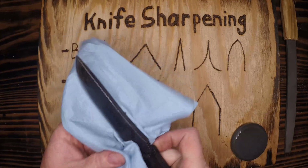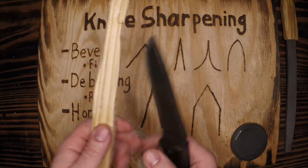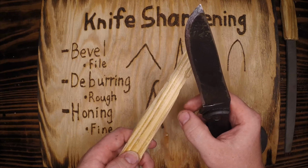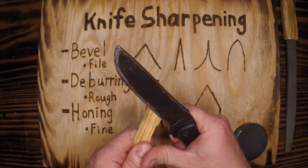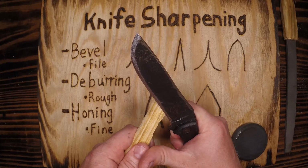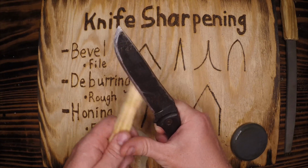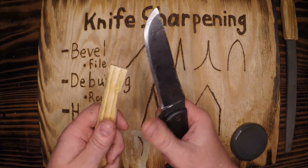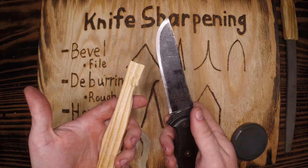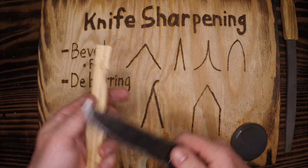The most common issue that we have is with carving, and I'll be using this piece here. Someone will want to get something carved down or knock off a piece of wood. See this little burr here? If you're cutting towards yourself, even if I'm placing a thumb for control, and I've got a little experience here, even if you've got a nice sharp knife, and I'm not pushing hard because this is a demonstration of knife sharpening tonight and not a demonstration on how to stitch up your thumb. If I pushed hard and I flow through the material, you can knock it right into your thumb. I have literally multiple scars from this exact issue.